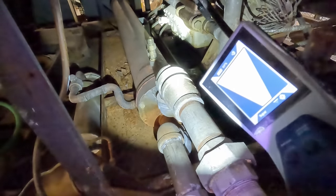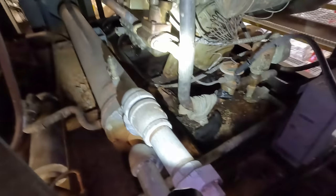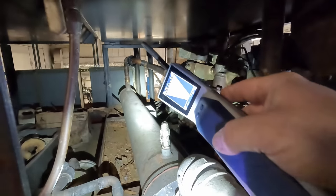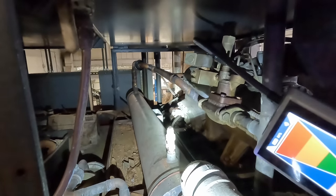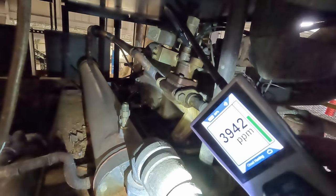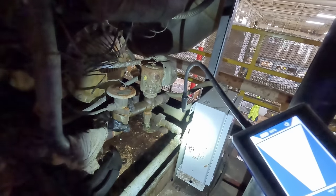We may have to put a cap on it until we can get back — I really don't know at this point. I've scanned all of the little capillary tubes and valves back here and for the most part everything looks pretty good, nothing leaking off the discharge or suction. Then we got something — let's go to parts per million. That is a very good size leak. Always check in your regular mode, super mode, high mode. PPM is not fast reacting, it's not made to be.